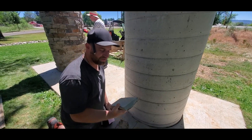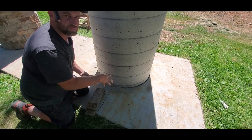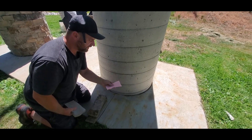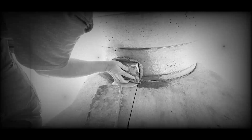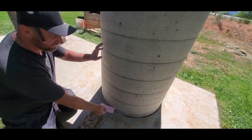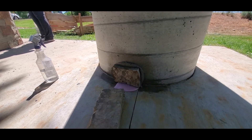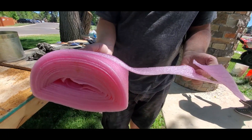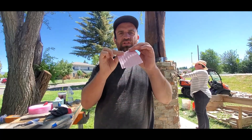It's not a good idea to put these straight down onto the ground. If the ground swells and the stone doesn't, it'll pop the stone off. I like to put a little spacer to hold it up off the ground. I'm going to mud the back of this and set it up on the spacer. When I'm done, I'll remove the spacer and that stone will be up off the ground. This is just a sill you'd put between your concrete foundation and bottom sill plate while building a house — it works great here and squishes a little bit.